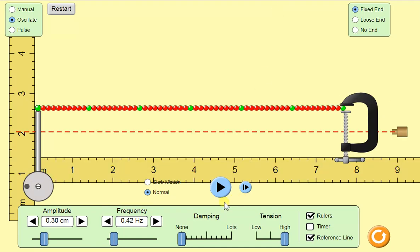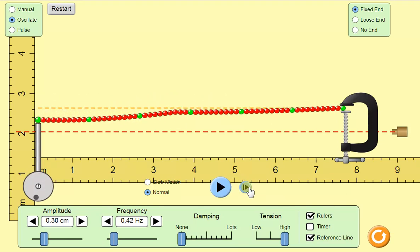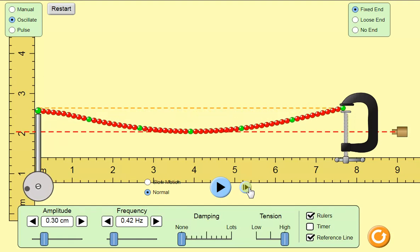This one is a half wavelength and we're going to see what happens in one cycle. One cycle — this calibration line is at 0.6 centimeters. In one cycle at 0.3 centimeters drive, we got 0.6 centimeters on the string. This right here is the antinode; the center of the antinode — if this were one of Tesla's bifilar pancake coils, this would be the center tap.